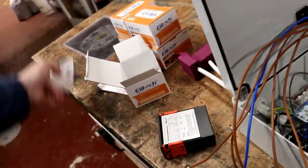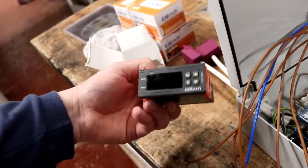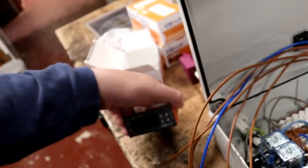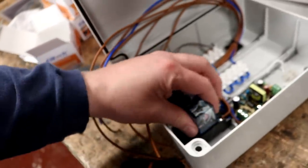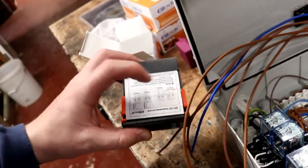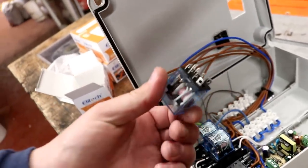We can start then to begin the job of cladding them. I'm going to need to go and get some heat blankets — I generally use the normal heat blankets you get to put on your bed, like ten pounds from Argos. Very cheap, and then we'll wire them into this relay here. We're not putting the load of the heat blanket through the STC; we want to let the relay do the work. If there's any problem we can just change out the relay. These are 12 quid, whereas the relays are about 50 pence each — I generally order them from eBay.